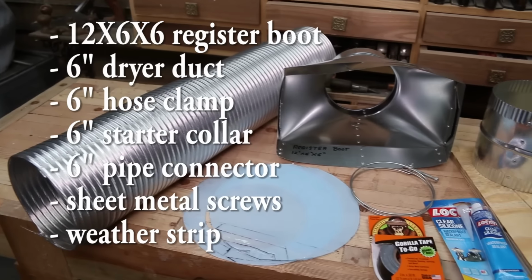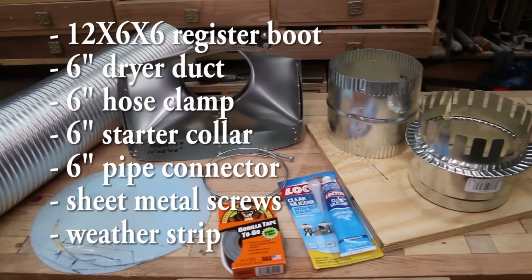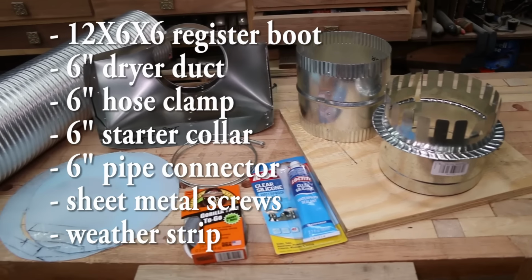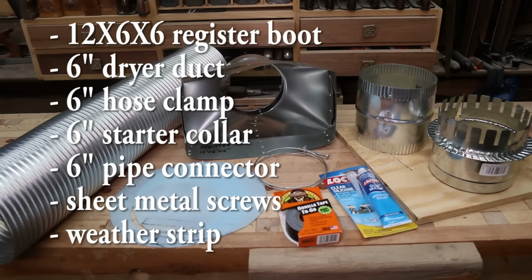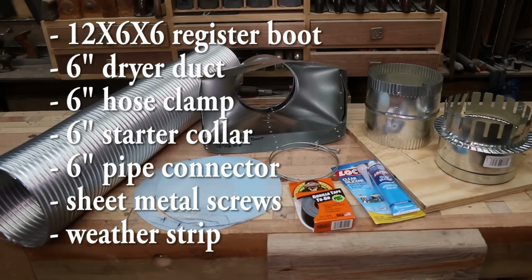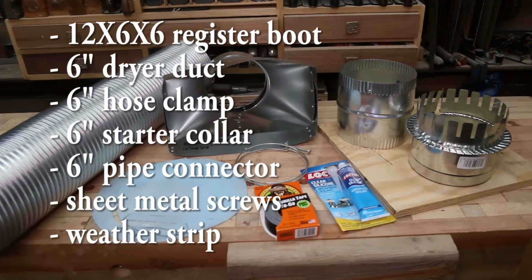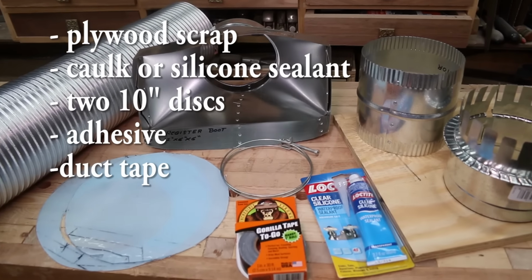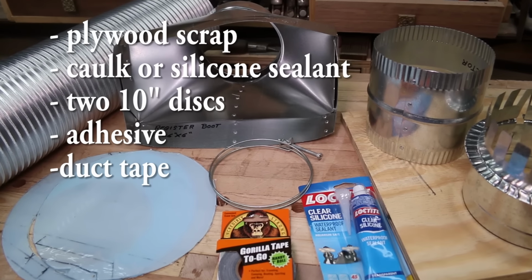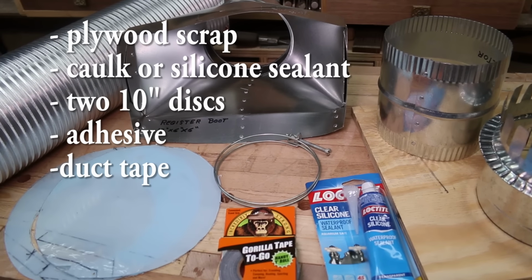For a ducted system, you're going to need a 12 by 6 by 6 register boot, a length of 6-inch dryer duct, a 6-inch hose clamp, a 6-inch starter collar, a 6-inch pipe connector, some sheet metal screws, some weather stripping, a bit of plywood, some caulk, and a pair of 10-inch discs cut from wood or plastic. I cut mine out of some thin plastic. You also need some adhesive and some duct tape. All of that should be less than $50.